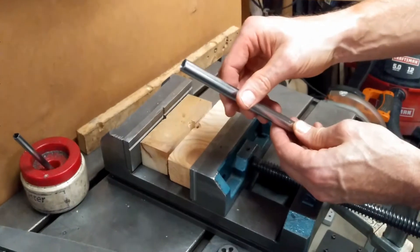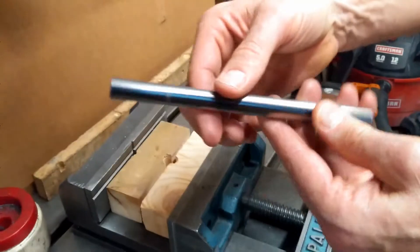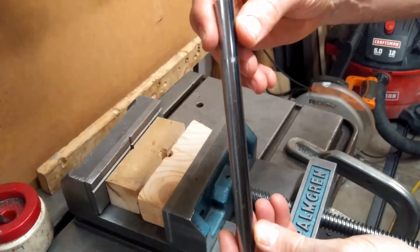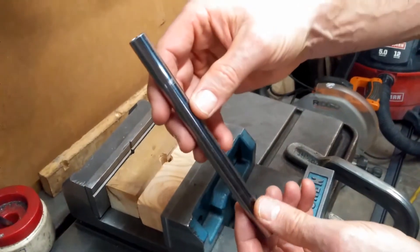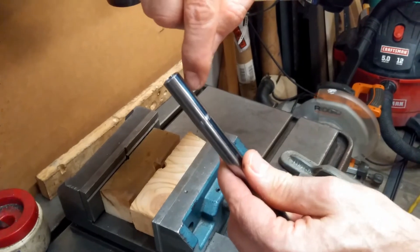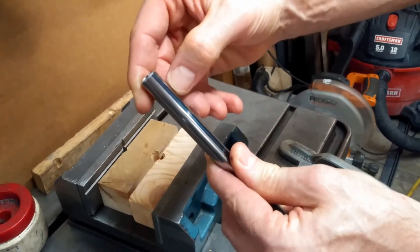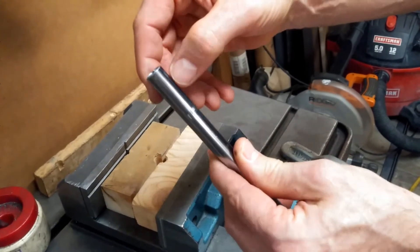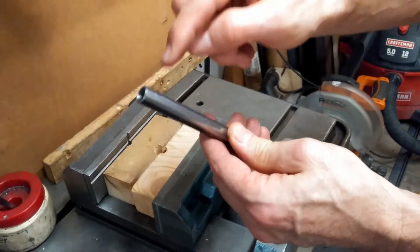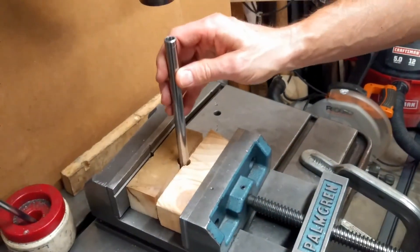But this is stainless steel — it's also the welded style. You can see the little weld line there, the blue. Those two things make it more difficult to cut with a die, because every time the tooth of the cutter comes past, it has to go through the weld and back to the non-weld. So there's some hardness issues there, and stainless steel is not particularly fun to machine anyway, at least not some alloys.